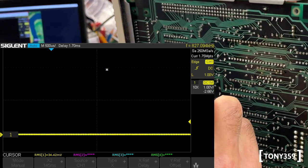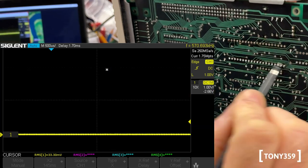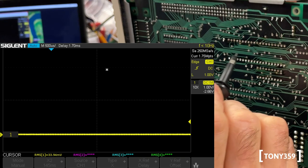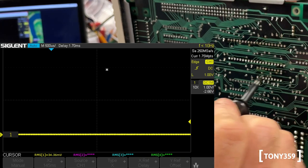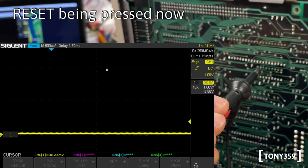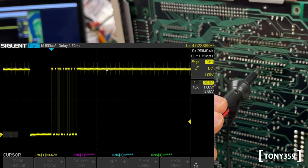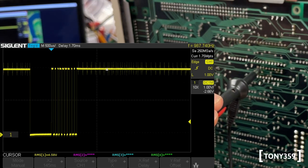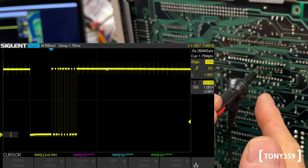The lines going to the VIA are absolutely and completely dead. However, one of the data lines on the processor does show some activity, so something is happening, but the ADB is completely stuck. I'm starting to feel that maybe the boot failure is caused by a bad VIA or the ADB refusing to initialize. When I reset the computer and it boots successfully, activity immediately appears on the ADB bus — the ADB chip starts talking to peripherals right away, and moving the mouse shows activity. It only takes about one second.